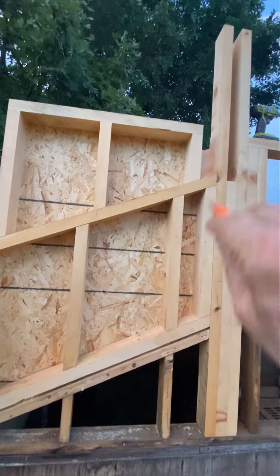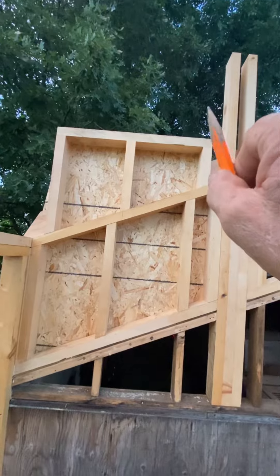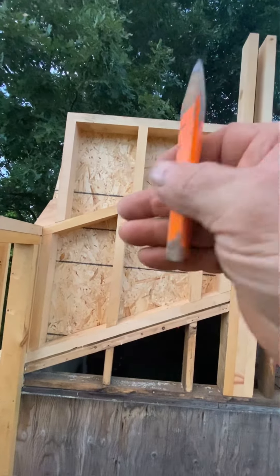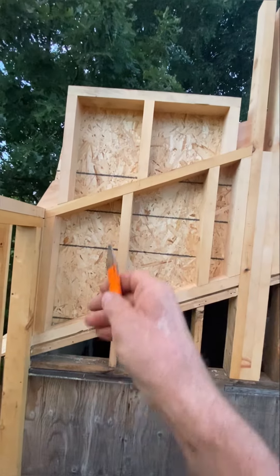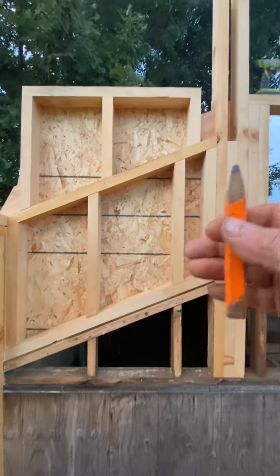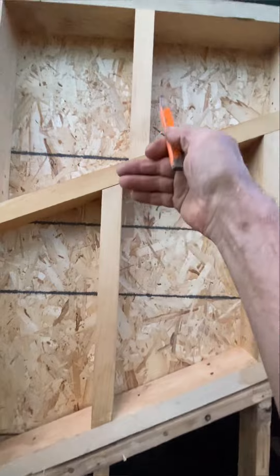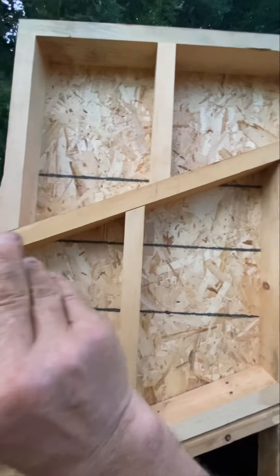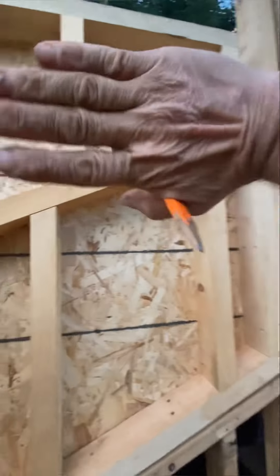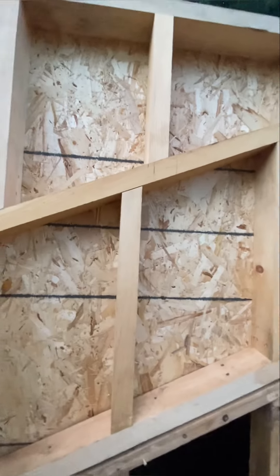There'll be a little piece there. Now the reason I had to frame it this way is because the tower actually has to sit on this roof. If I started at the base wall and did a tower, there'd be a big open gap there, which would be terrible to waterproof. So the taper on this side, which is a plumb wall, will actually terminate on this sloping roof, which is indicated there. So there'll be an inside rafter on the inside here where that taper will continue.